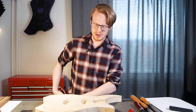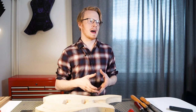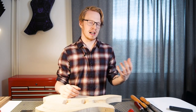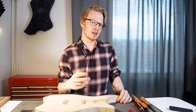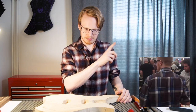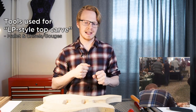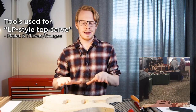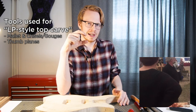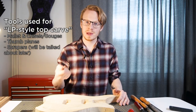Yes to all those. I have a certain way of doing things. What I've done in the past — one of the first guitar tops I actually carved was at Crimson when we went to Yandals, and I spent two days carving this guitar top. I'll put a picture and probably a bit of the time-lapse in here. Basically, at first it was carved with just a mallet and some gouges to rough carve it into shape, and then I used these tiny hand planes — thumb planes, usually called violin maker's planes. They were about that small, and I spent two days just carving the entire top with that by hand.